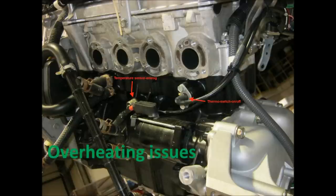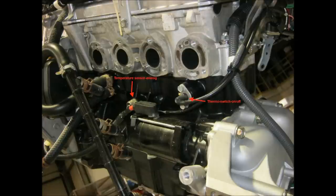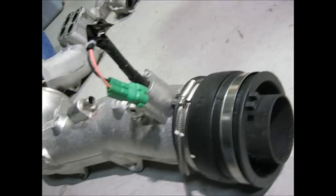Since my understanding of the cooling system grew out of chasing an overheat issue, I decided to include some items that may be helpful to others. The cooling system is monitored by three inputs to the computer: an analog sensor located near cylinder number three, an on-off temperature switch located near cylinder number one, and an on-off temperature switch located on the exhaust pipe. Perhaps the most common cause for overtemp warning lights to come on is obstructions in the jet pump, which causes cavitation and low cooling water flow — simply not enough water to remove the heat.